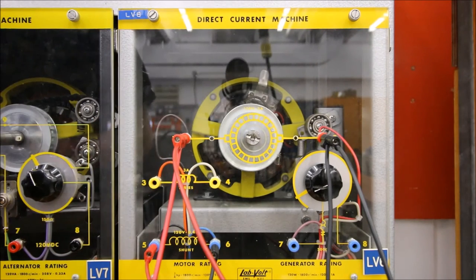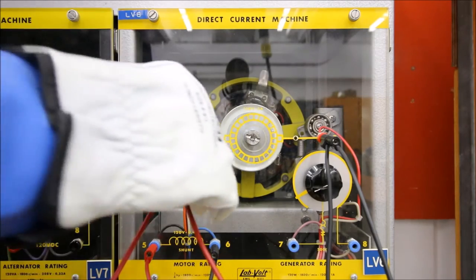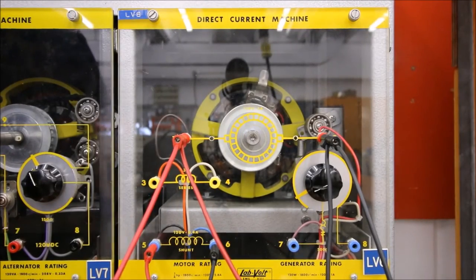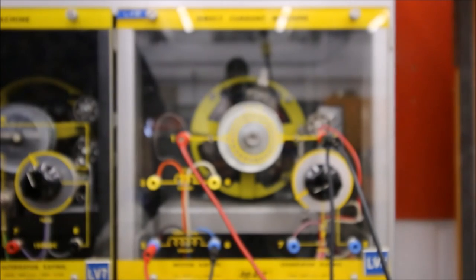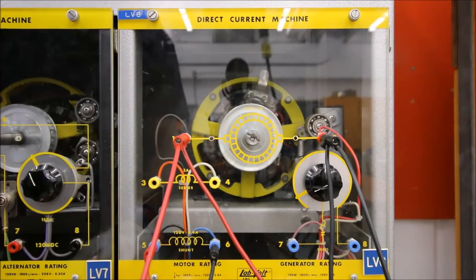We're going to create some opens on the shunt motor. A was the feed to everything — the feed from the source. We turn the motor on and take away the feed to both electromagnets, and obviously that kills the motor. That motor comes to a stop — actually a lot faster because the series was going so fast. The shunt wasn't going as fast with that load. So that was A.